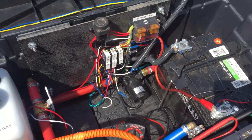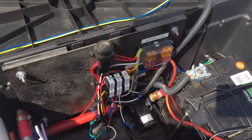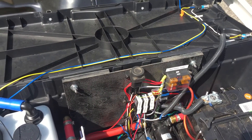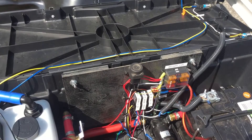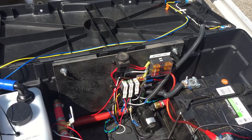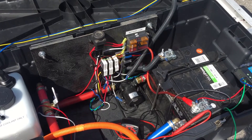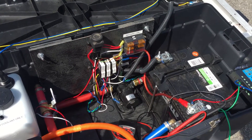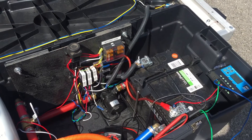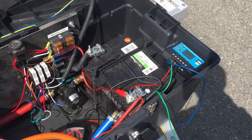You can see my relays here. I put an inertia switch here that's connected right at the main switch, so if there's ever an accident or somebody bumps into the trailer it kills power to the whole thing — the coolant lines, everything shuts down, the pump shuts down. I'm sure stuff will still leak, but it'll shut everything down, so I figured that was the safe approach.